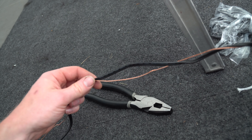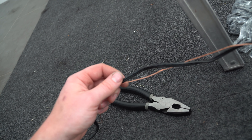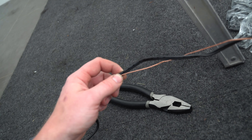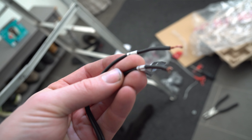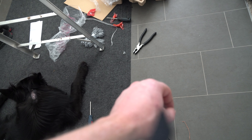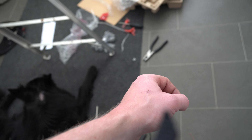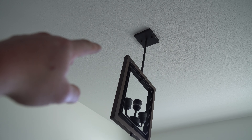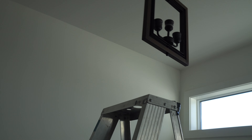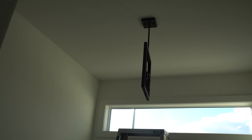The neutral wire — your white wire — is the ribbed cable, just in case those tags come off. You'll need about this much wire coming out, so go ahead and cut. If you're not set on lighting height, do not cut until you're ready to make a decision, and make sure you're keeping the light because once you cut there's no going back. Slide the wire through the plate and then through the mounting hardware — threads aimed so they screw into the back side of the plate — and you'll need the crush washer and flat washer first.